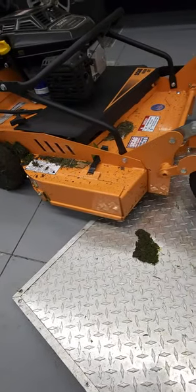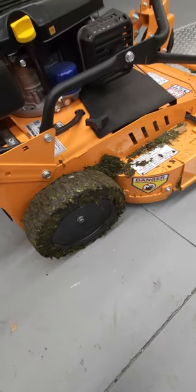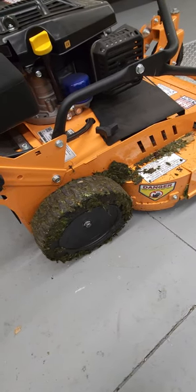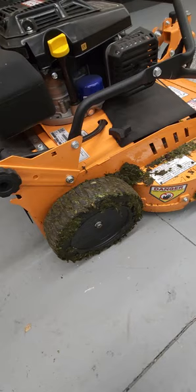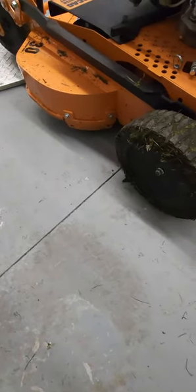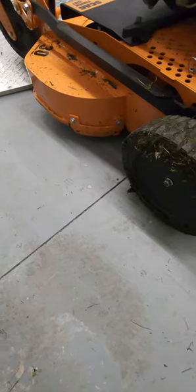On to the negatives. At the third property, as you can see, it was pretty wet — I'm filming this right at the end of April 2023, still in our wet season up in the Northeast just outside of Buffalo. The mower really struggled on just minor hills because these would dig in. I'm at exactly two inches cut for that customer — you can see where I've got my pin set, third notch up. It is relatively low to the ground; usually you're mowing two and a half to three inches for most customers, but those definitely caught on the ground especially going uphill.